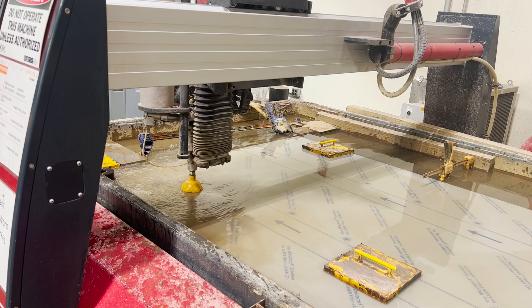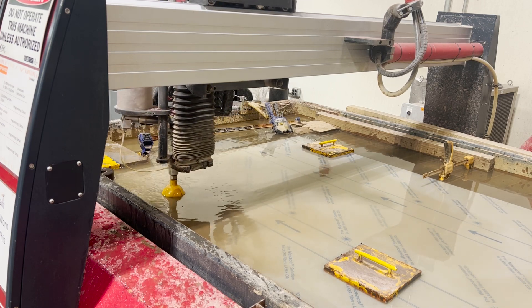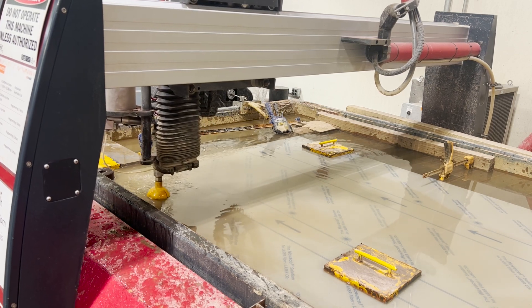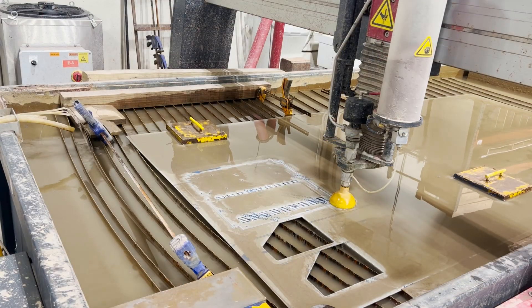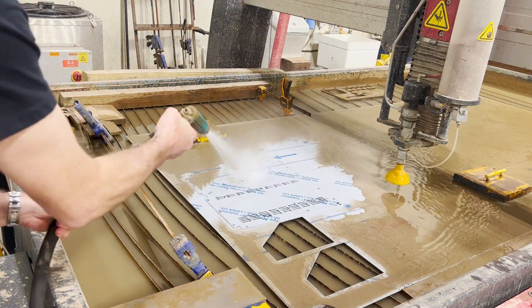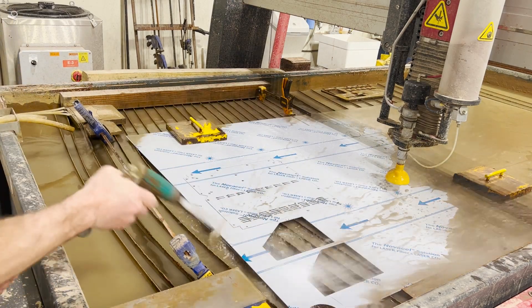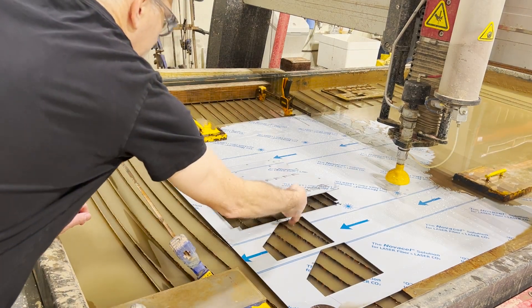You can see it's traversing along. You just have to put in what your material is, the thickness of that material, and it calculates everything for you — pretty simple machines to use. You see it lowering the water level; you just raise the water level to keep the noise and the splashing down. This is stainless steel that would be difficult to cut on a laser, so that's why it has that coating, but the water jet just goes just fine.